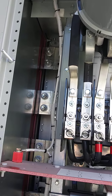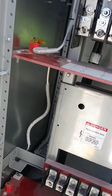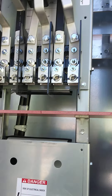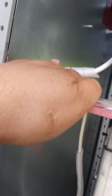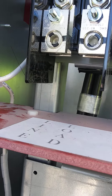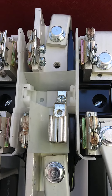The manufacturer of the gear also failed to prep it right for the rest of the meters to go in place. We're going to help the next guy out because it's really a messed up situation we got ourselves into. We're going to land the neutral right here before coming out and hitting the small neutral needed for the meter sockets, which for this one and this one is right there.